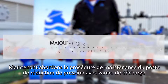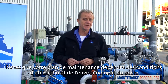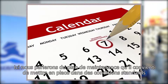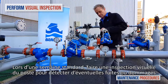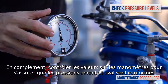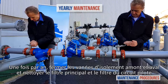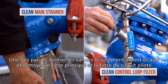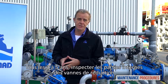Now let's discuss maintenance procedures for the Bermad PRV pressure reducing station with the relief valve. Note that your schedule for preventative maintenance depends on the actual conditions of use and the station's environment. On a weekly basis, perform a visual inspection of the station and check for leaks or external damage, and observe the unit's pressure gauges to make sure that the pressures upstream and downstream are as they should be. Once a year, close both isolation valves and clean the main strainer and the valve control loop filter. Every three to five years, inspect the internal conditions of the pressure reducing valve.